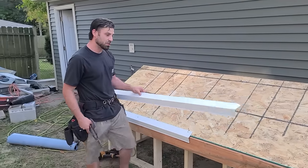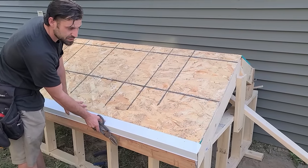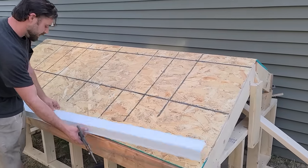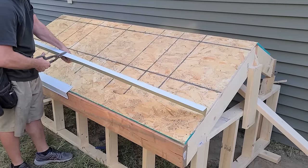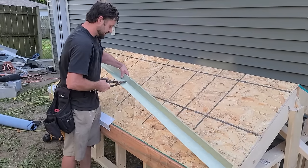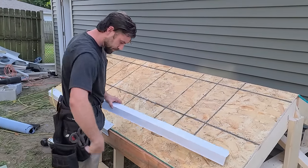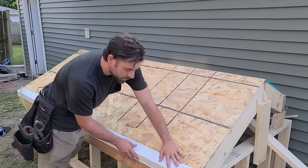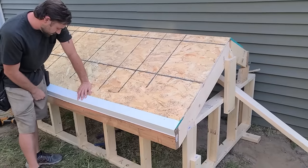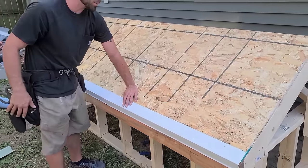This piece was long enough to go across, but I wanted to show you guys how to seam it. It's real simple — you just get it somewhere close and pick a couple inches of overlap somewhere in there. No need for a pencil or to be real precise. Just cut that and put this on flush. You don't want a super big overlap, otherwise it can get a little bulgy, but a couple inches is not that serious.